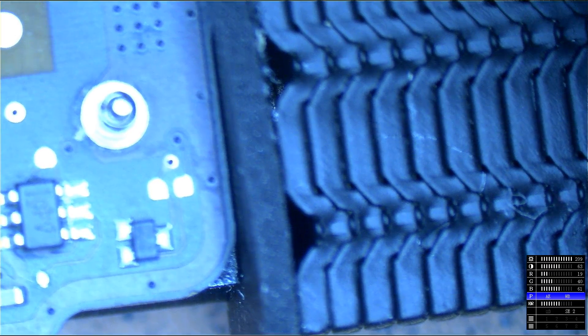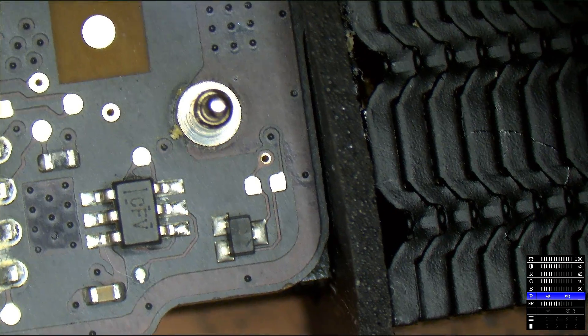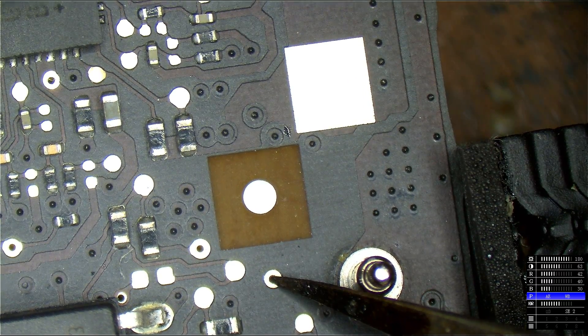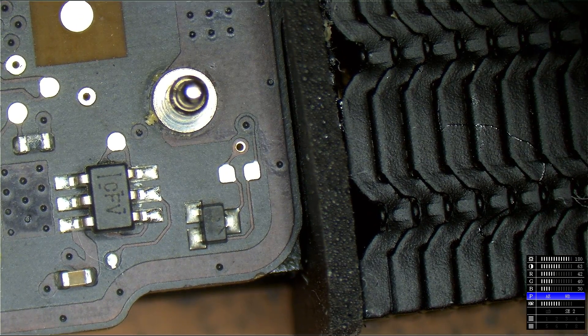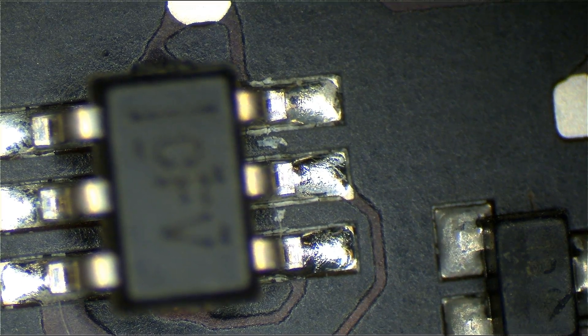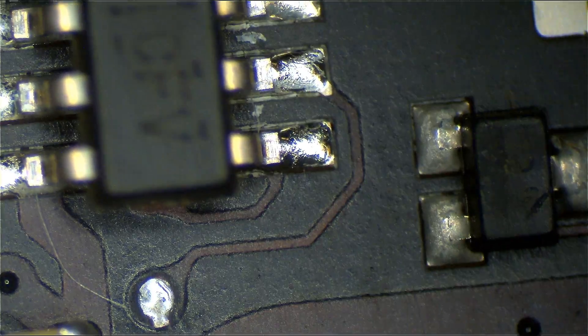When I started using my brain, I looked around the board, and I found that one area of it did not look nice. Let me just reset this camera so that it looks decent. So this section of the board - you can see there are these probe points, these holes. This one over here looked kind of rusted. So let's just zoom in and see what I did. What I did is I filled the hole up with flux, and then I had my iron there, sitting on top of this hole.